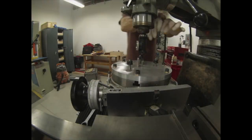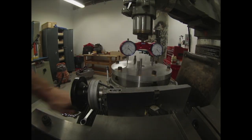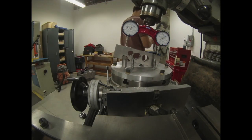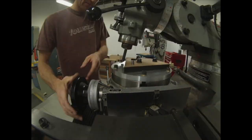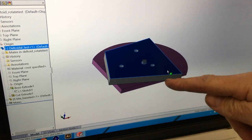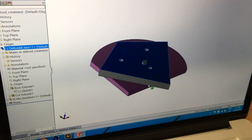I said before you don't need much math to make these shapes, but in this instance I'm using a spindle square and a sine bar, and I'm using trigonometry to change the angle of the head. That gets the end mill - the cutting surface - at the correct angle up against the wood. After I changed the angle of the head and got the end mill at the correct angle, I then had to figure out on the rotary table how far I have to rotate this thing around.